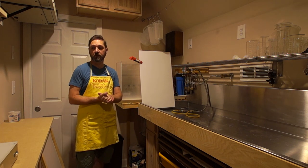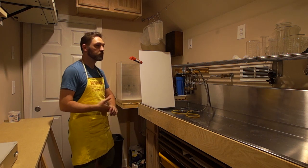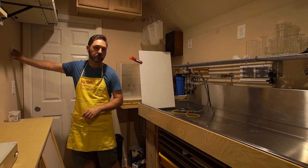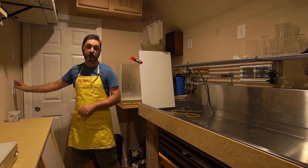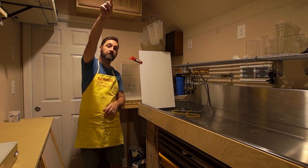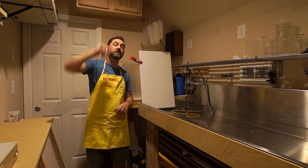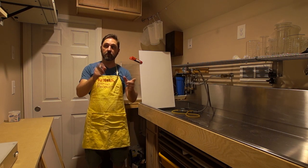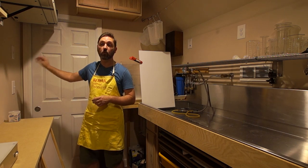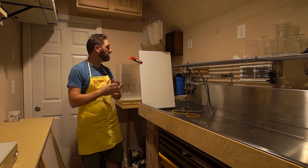There's nothing else in here other than a trash can. I've got a light switch up here — this one is for the room lights, and this one is for the safelight. Since I was able to custom make this room, I put an outlet on the ceiling for the safelight, because the safelight cable is only so long. I put a separate switch so I wouldn't accidentally hit one or the other — I know which one's which.